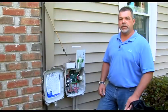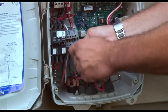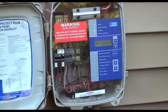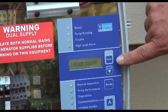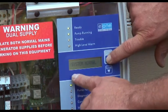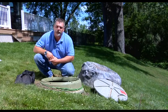Now that we've finished the MEG test, we reconnected the EQDs at the station and rewired the panel. Let's make sure all the screws are nice and tight. The last thing we're going to want to do is a manual run test to test the system. We can now power the station back up — turn both breakers on and wait for the system to repower. On the screen, you'll see it says 'power rising.' System is now ready. Once the system is ready, hold manual run for two seconds — the pump will turn on, the LED for the pump running light is lit. The display shows 238 volts, 5.6 amps. You can refer to the charts in the service manual for normal operating amps, which is 5 to 8 amps.